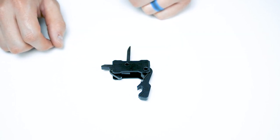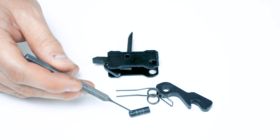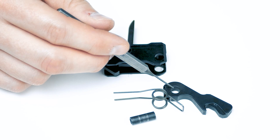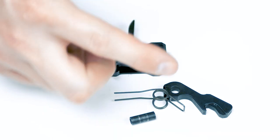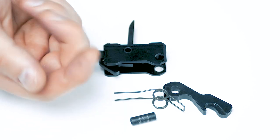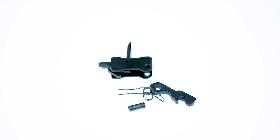Let's move on to a more exploded view, if you will. Once the hammer pin's out of the body, you'll have a couple of things to work on. You'll set the heavy spring around the hammer, then place the combined two pieces into the trigger group, and start working on reassembling. You'll find that everything goes back together a little bit nicer if there's some pressure on the hammer spring while you reassemble. Once the hammer spring and hammer are back in the body and the pin holes are lined up, I recommend inserting the pin from underneath. While it isn't directional, I find that it fights you a little bit less and your hand-eye coordination is your friend when installing it from below.